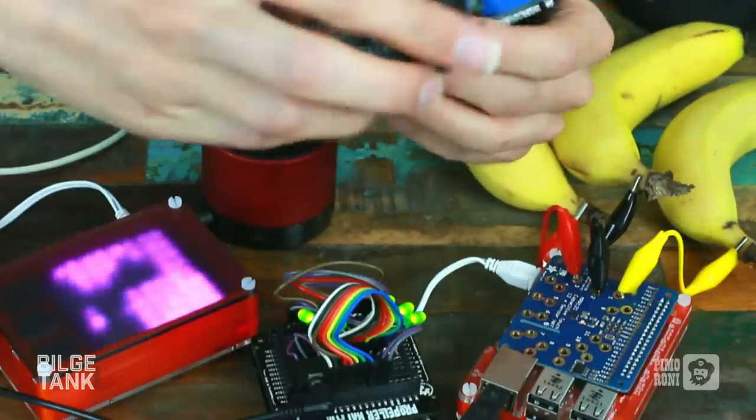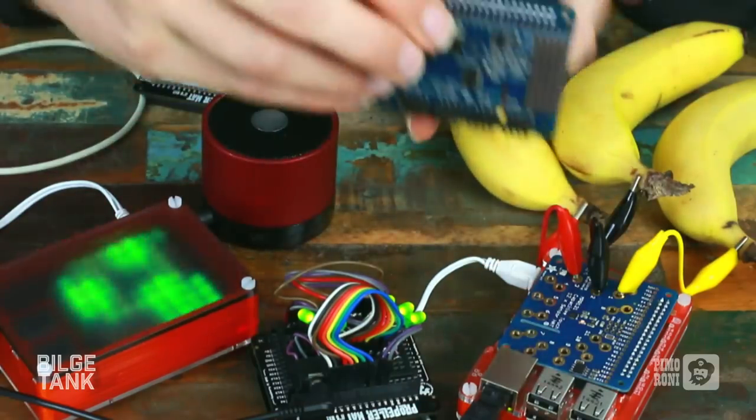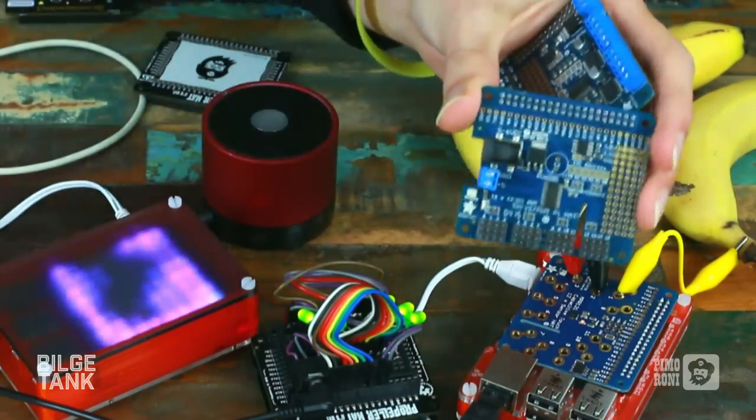16 channels. Nice. So that's not quite enough for a fully articulated hexabot, but that's a lot of servos. And, common with these big driver things, they need an external power supply if you're going to drive a lot of stuff. Motors take a lot of driving, and they just have these huge spikes of current. They're very noisy as well, so a well-designed breakout board saves you from a lot of pain, doesn't it? They're not the easiest things to work with. They're nice boards, but these make it pretty easy.